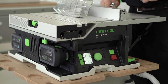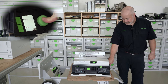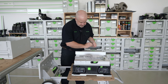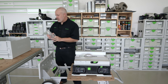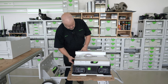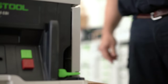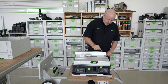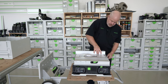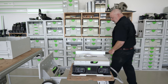Next, I switch out the protective covering. To get it to the proper height, I set it to the park position — go to the screen, select P, press and hold. I'll take the supplied wrench, remove it, lock the new one into place, and put it back in its special spot. I'll put the outfeed table up by pressing on both arms, sliding that down, and that locks into place. I'll make sure the fence is in the correct park position by lining that edge up with the P arrow and locking that into place. With the blade in park position and everything ready, I'll go ahead and power it off. Now I can put the lid back on.